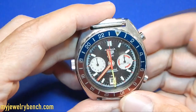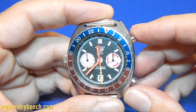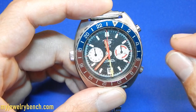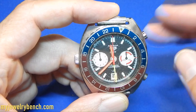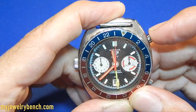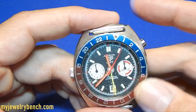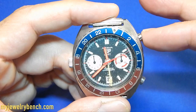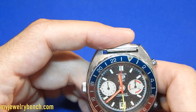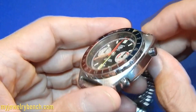This watch is a very complicated watch — not just to set and run. The parts literally number a few hundred making up this whole movement. This watch came in for service about seven months ago. The customer never used the stopwatch and here in Florida it's hot and dry most of the time. Sometimes the parts that need grease get dried up a little bit. I did a quick service to make sure everything was lubed up. Under normal circumstances, 40-45 years of wear means springs lose their tension and parts wear down to a point where we can't fix them anymore — we have to either make them or find a donor case.